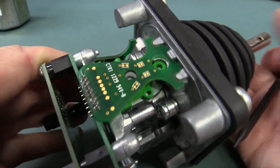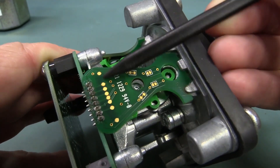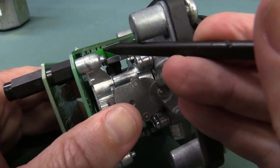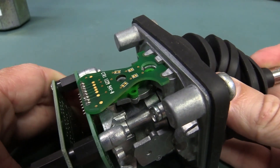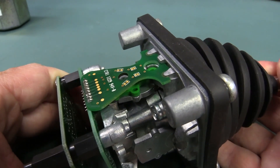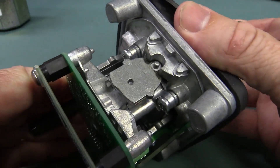So just like your range switch in a multimeter, they've got the pads — you can probably see through the PCB there onto the other side — those dual wipe contacts, dual wipe either side, so they can determine when these things have been moved.